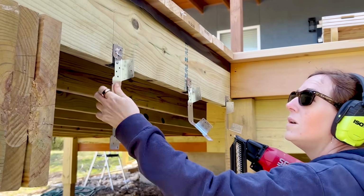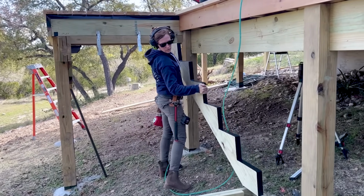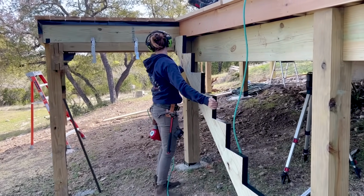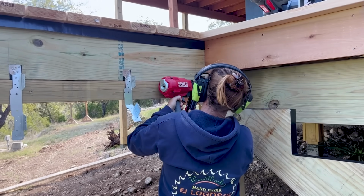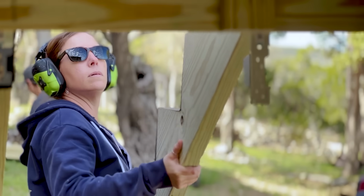That is so amazing. On picking material, you should always use 2x12s that are treated and meant for ground contact. Now, be picky when choosing your boards. You want nice and straight without any big knots or splits in it.